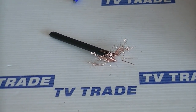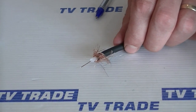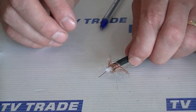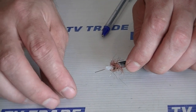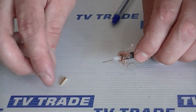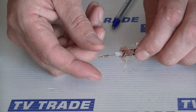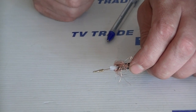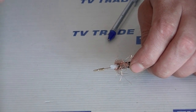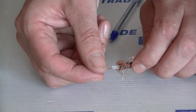The core wire would normally be around 0.6 millimeters or so. The key point is we want it thick enough to carry a signal over a good run, but thin enough to be used with a BNC connector. So the key test is just sliding the pin on — you can see it slips on quite nicely. This would be compressed into position with a crimper when putting it on.